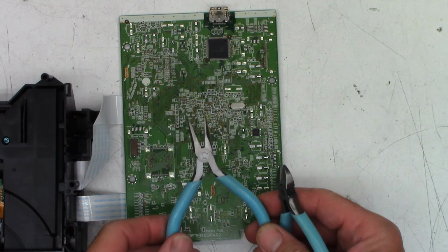And I'm going to go ahead and stand up the fluorescent display, the VFD, vacuum fluorescent display, because it was tilted back. I don't know if I did that or if it came that way. So I'm going to begin by opening the door like I said, and then just pushing all this together. That should be good. Get my drill out from underneath it. And so it is snapped back into place. There are a couple of snaps on the sides as well. And if you notice, that snap has a ground underneath it. And that goes around the video jacks on the front to keep a ground shield around it.